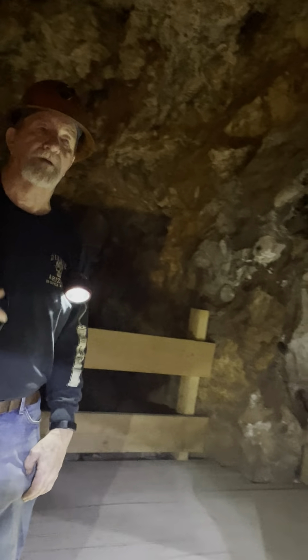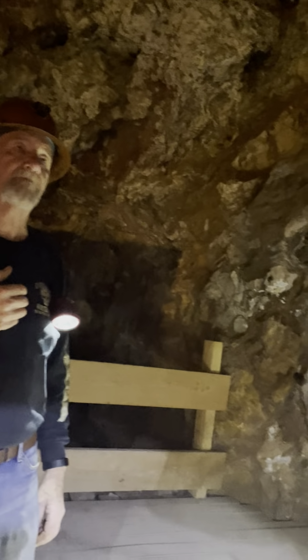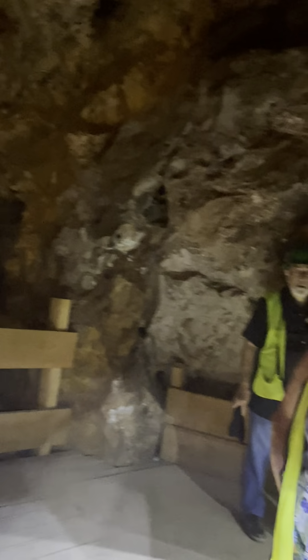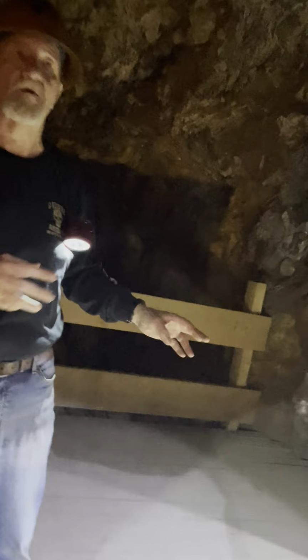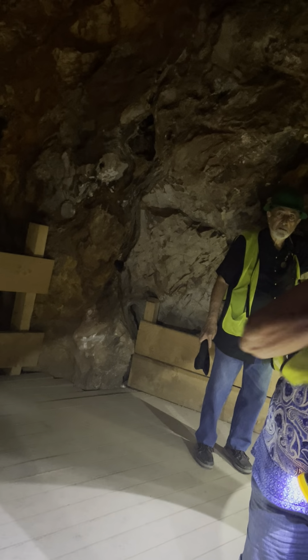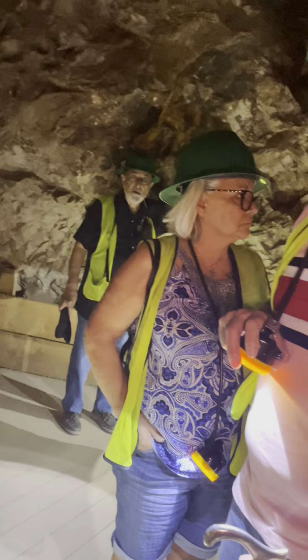Normally when we drilled 7 foot deep, it'd take about 28 to 30 holes to blast. But I'm talking about the old days. They did about 4 feet, because it took 8 hours to get those 4 feet. They'd blast whatever holes they had. But normally it'd be around 4 holes, 4 foot deep, on average. Sometimes less, sometimes more, depending on the rock.